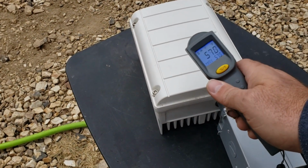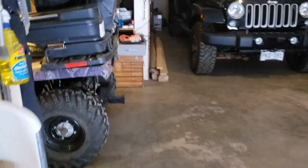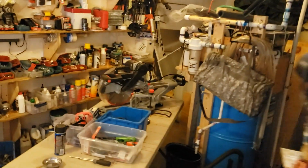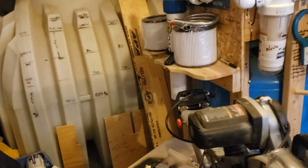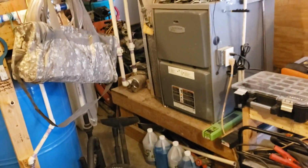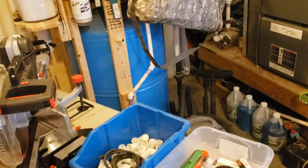So ambient temperature, it's getting colder outside too. 42, was 50 earlier. All the wires are like 60 degrees, 52, 48, sorry. Nothing's heating up except for that short piece of wire right there and that switch. We got 136 just now, but you can find 145. The highest I got was, even the fuse isn't that hot, 116.